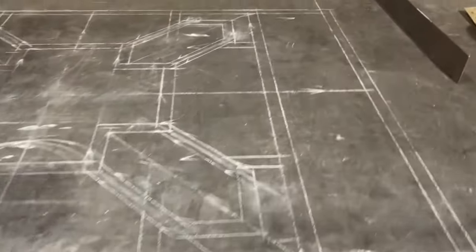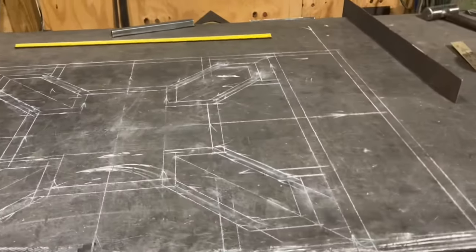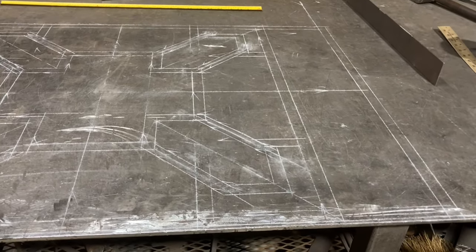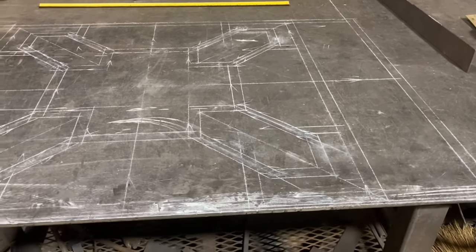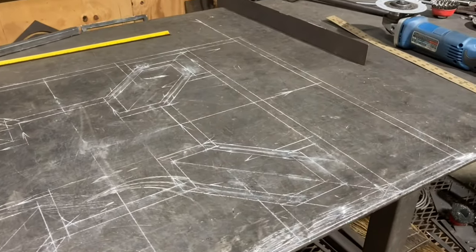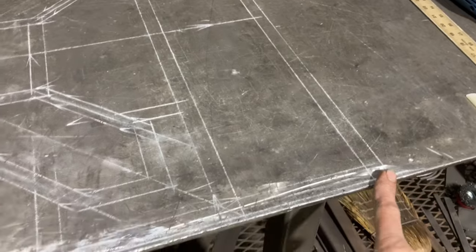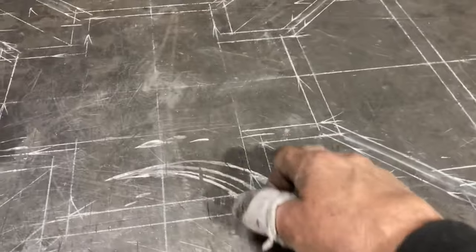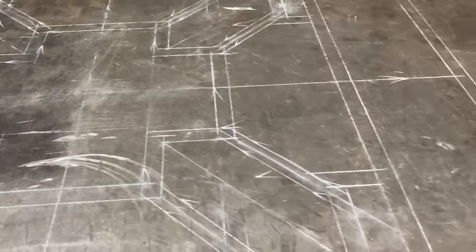It's just going to go over windows. The first thing I'd definitely do different — I hadn't done anything but draw it out — is draw it out on plywood. Because now if I do more than one, I have to do them all at once or I'll have to draw it all out again. On plywood you can just set it to the side and pull it out whenever you want. Definitely draw it out on plywood if you do this. I'm going to start out by doing this frame, get it put in, then probably this, then start cutting out this cross right here, then add in all the corners after that.